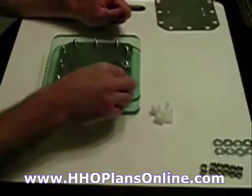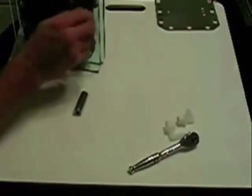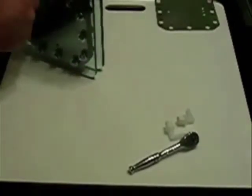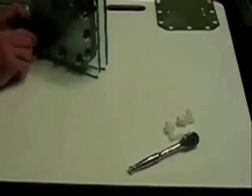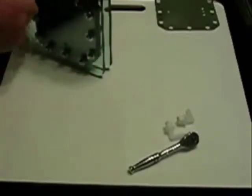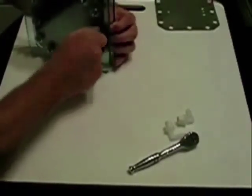Come back and put washers — you can use lock washers, but I'm using the small fender washers for now. When you're torquing these — I'm just doing it hand tight right now — make sure you do it in a star pattern, like you would when changing a tire or putting a wheel back on a car. That ensures you're getting even pressure all the way around.